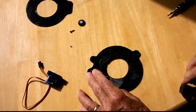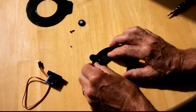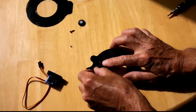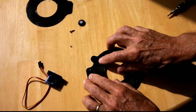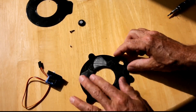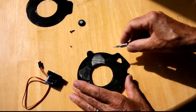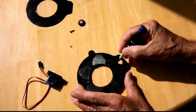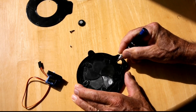Since these shutter blades don't mesh perfectly, I'm not going to interleave them — I'm going to put them on top because if you interleave all the shutter blades it just won't work. The blades aren't thin enough, which is kind of unfortunate. Let me just test it here — yeah, there we go. It opens and closes just fine. I think it's always cool to watch how these things work.